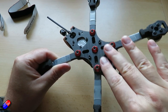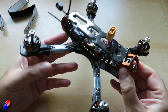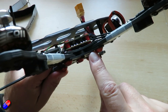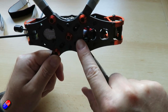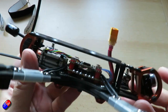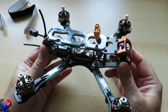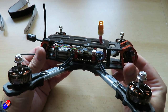In the older days they did some versions of their models with a single bottom plate, but this feels very much like it's made out of one piece. Of course, if you don't have all that noise going into the flight controller — and there are actually some pieces in here like very thin foam that's clamping these arms into position — that also helps dampen vibration. Everything on this ready to fly version is on vibration isolating mounts, surprise surprise. That does mean that if you're playing around with tunes and the black box stuff, it's going to be a little bit easier — you're not going to have to work around all of that vibration.